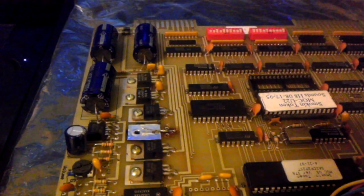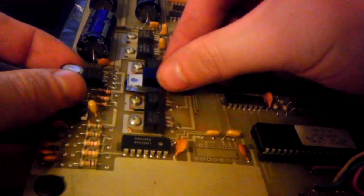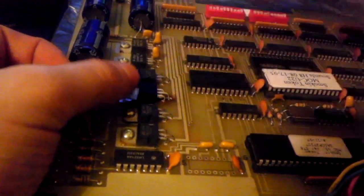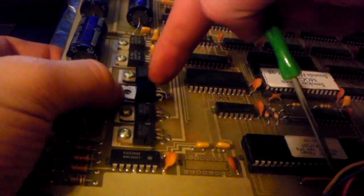With the component removed, we're ready to fit our new transistor. I did have to add some metal and mess around with some wires here to try providing conductivity. Looking at the other transistors and some of the burn-through, it looked like they were connecting the metal bracket of the transistor to the center lead. So I went ahead and reconstructed that on the board as best as I could with some stranded copper wire and some thick metal. It should dissipate heat while maintaining conductivity just fine. I've already gone ahead and bent the pins, and it looks like it needs a slight adjustment — and there we go.